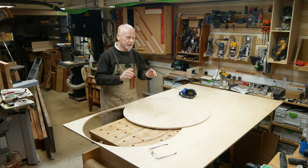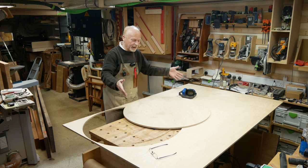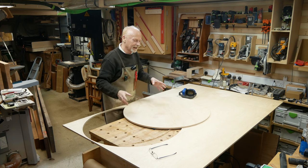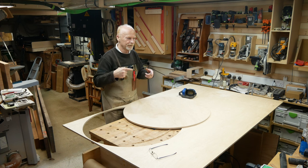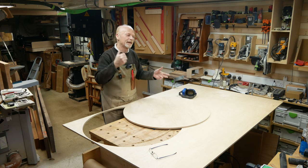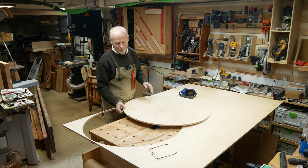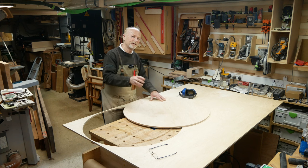So now I need to cut the border pieces. In order to save wastage, the border pieces are obviously 800mm diameter as well, so that would be masses of waste. In Vectric, I divided the circle into quarters and drew out these quarter bits. I tried cutting it on the laser, but that was a no-show because the ply is so dense it didn't want to play. So I'm going to cut these bits out on the CNC. Use every tool you can lay your hands on!